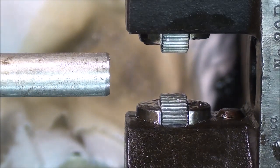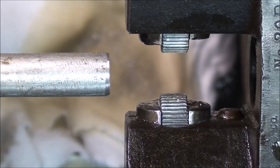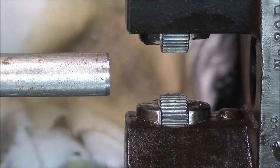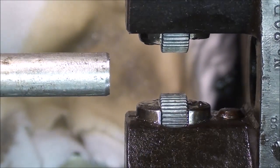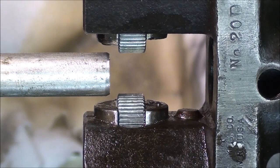And now, since I'm having fun, I think I'm going to run a straight knurl. Well, I know I'm going to. Notice that I readjusted the knurlers so that they are at 0 degrees. In other words, they're straight across, and we're back to aluminum and 200 RPM, and nothing else has changed. So let's run it in there. I've chamfered the work just a little bit.